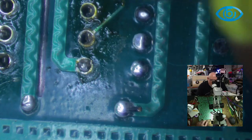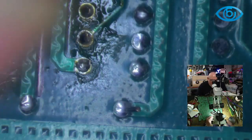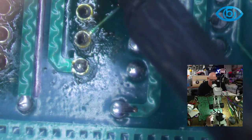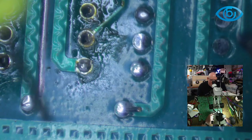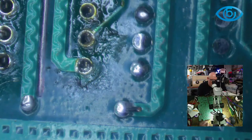And so what I have here is a solder needle, which I demonstrated last time. What you can do with these is heat this hole up, and then you push the needle through, and it pushes the solder out of the way. The solder won't adhere to the needle because the needle is made out of stainless steel. So you can try and get your way through with those. But there is what I consider to be a much easier way to remove a chip like this.